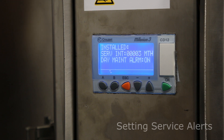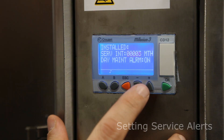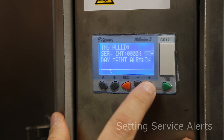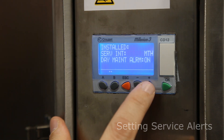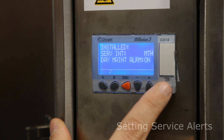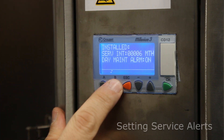This screen sets the install date for the unit, which is automatically logged when a mains power signal is detected for more than 48 hours. A great feature on the unit is the pump out reminder notification. This can be set in accordance with local regulation requirements or when you feel a full pump out will be needed. To change the pump out frequency, select OK and using the plus and minus buttons you can increase the interval — in this case we're changing it to once every six months. Press OK to save. The user's daily checks reminder can also be switched off for applications where it's not required, by toggling button B.